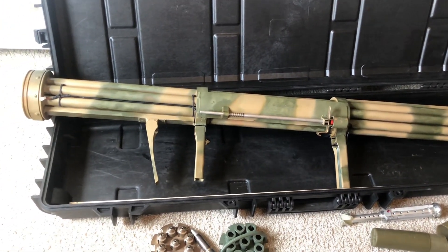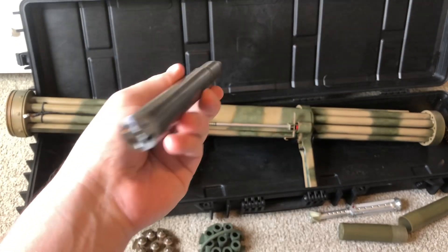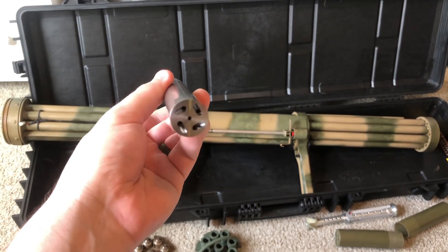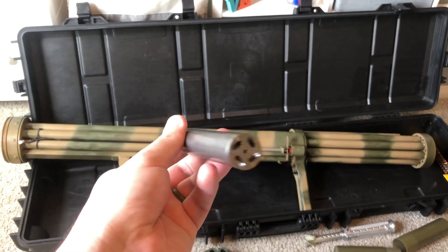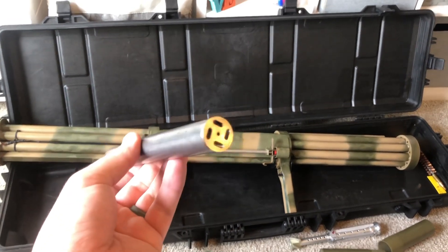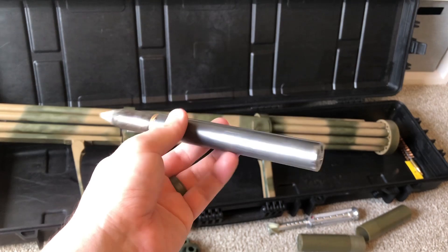I've got more information in my book covering this — I'll put a link. It is chambered in 20mm. It fires nine of these gyrojet-style rockets using four angled nozzles that create spin, and that spin creates stability when the rocket is leaving the barrel. These continue to burn even outside the barrel. I don't have a formula yet that will burn out the entire fuel capacity before it leaves the barrel, but for now it's burning out at about 0.3 to 0.4 seconds.